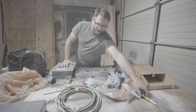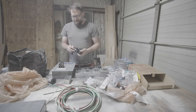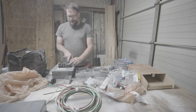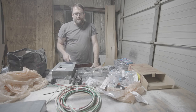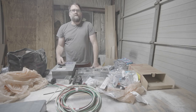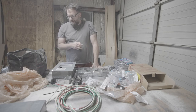This whole box is going to get stuffed with a bunch of breakers. We have a master 50, some 30-amp breakers, and I opted for a combined multi-breaker for 30 and 20 amps, plus a little breaker for the light switch. Between these, we're going to have four 30-amp circuits. Now, 30 times 4 is of course more than the amps available on the main. So if everybody's pulling 30 amps simultaneously, this 50-amp breaker is going to protect the circuits. Ideally, if every device is pulling between 2 and 5 kilowatts of power, it's going to be great.